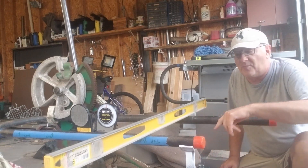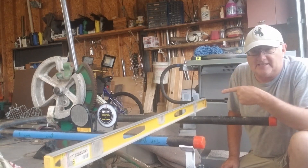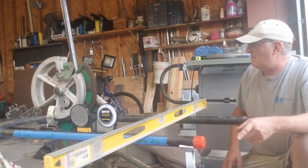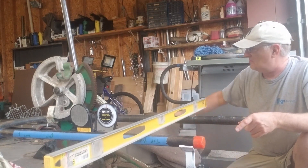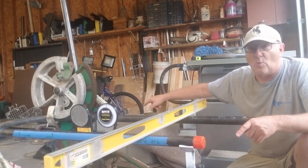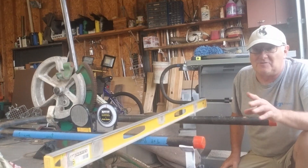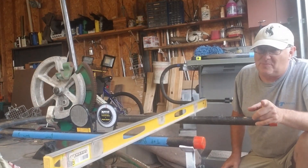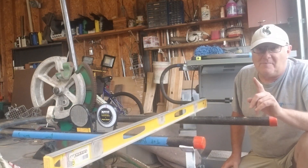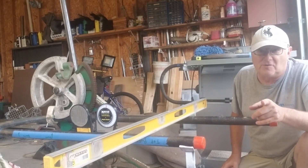We'll have to pull off the jack stand and get it out. The question is, will we get 61 degrees down there before this hits the floor? If we do have a problem, we're going to have to switch it to the other side, which might be even more of a problem because we have the wheel and spud over there that we could hit as we make the bend. So we might be creeping up on this one and might have to go back and forth. We are going to make marks on our pipe so we know where the wheels were so we can always repeat.